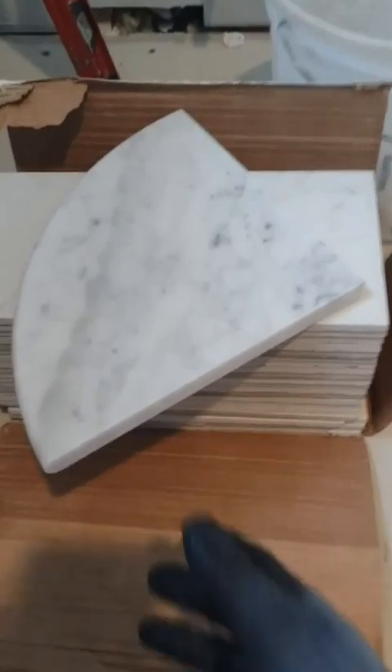How do you install a corner shelf like this in a shower? Well, it's easy. You're just going to have the corner shelf rest on top of the row of tile that you last did, and then in the corners and on the edges, we're going to back butter that with thinset, and that is plenty to hold it in place. The tile themselves offers some structural support, and the thinset will keep it in place.